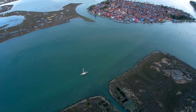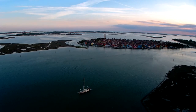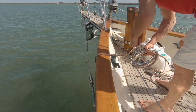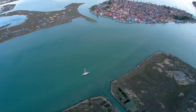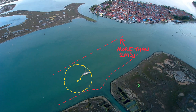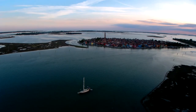We used it in Venice. From overhead you can just about make out the reality — as well as the mud close to shore, the whole middle section is also a mud bank, leaving a tiny sliver to anchor in. Enough room to set the anchor but the swinging room is the problem. The reason for the kellet is to weight the chain and limit the swinging circle, keeping us off the mud banks. The ultra ring passes through the chain gap, clips closed and slides down to the right level. Using the kellet shortens that swinging circle, letting you anchor in places where you wouldn't normally be able to.